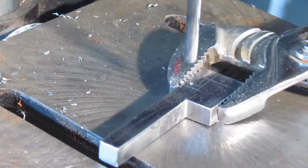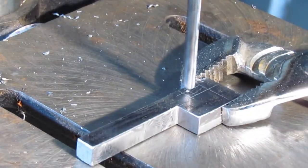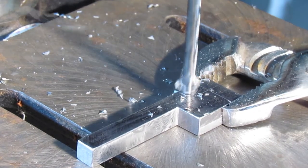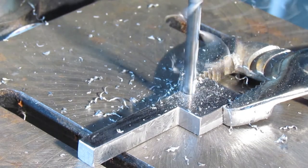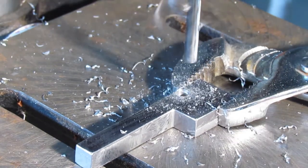A sharp drill with the correct grind easily finds the punch dimple. Watch the drill in the breakthrough. Ease up on the handle to avoid the part being grabbed by the drill. Also, use pliers to hold the workpiece whenever working close to the drill bit.